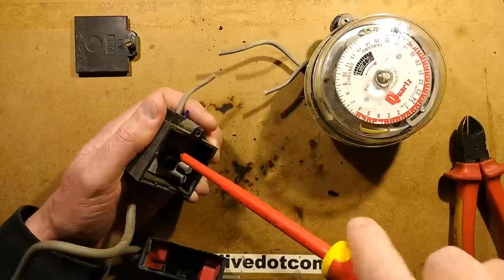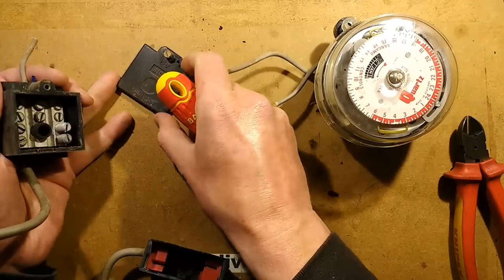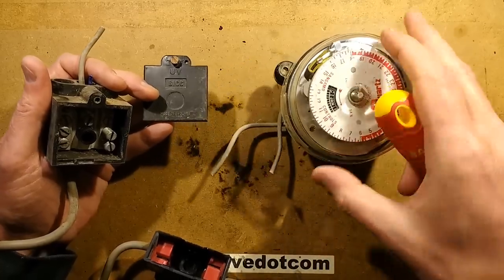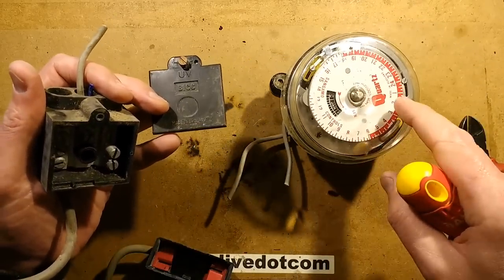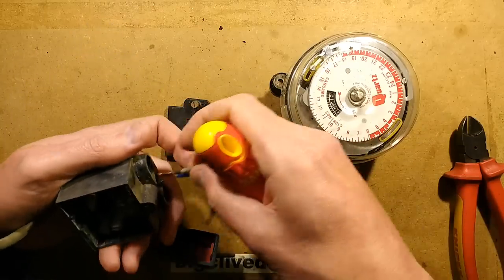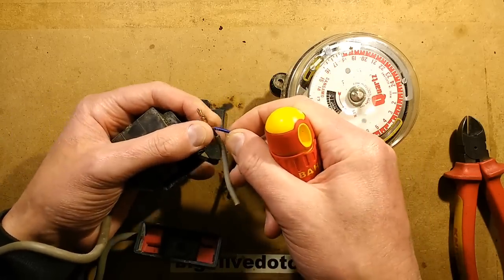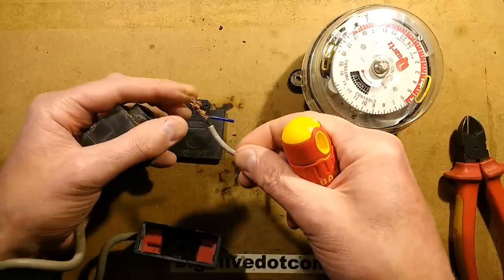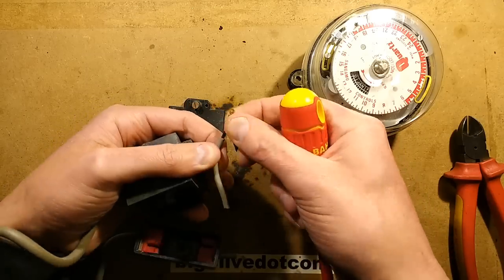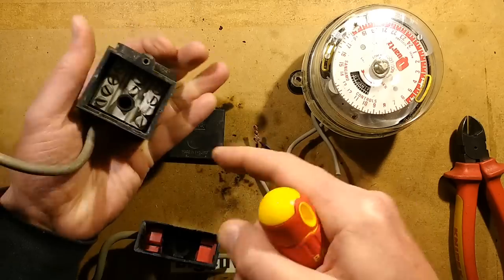This is a commoning block for large cables. One is made in England and the other says made in Scotland — refreshing, though sadly all old stuff. The thin flex cable here has been feeding the light probably via the ballast, and they've twisted it around the folded-over end of the double-insulated cable just to fill the terminal and get a good connection.